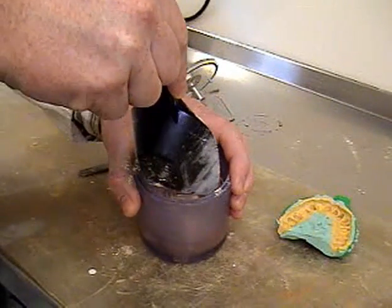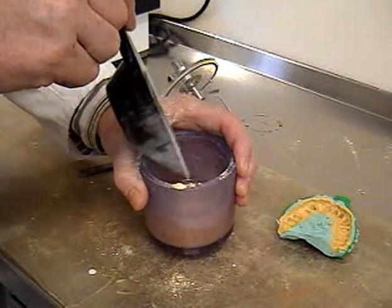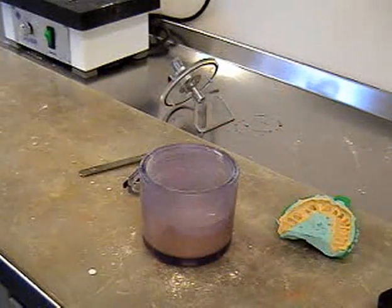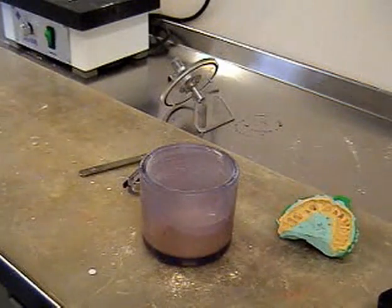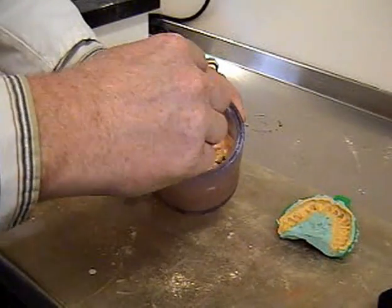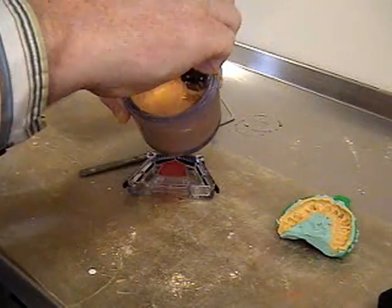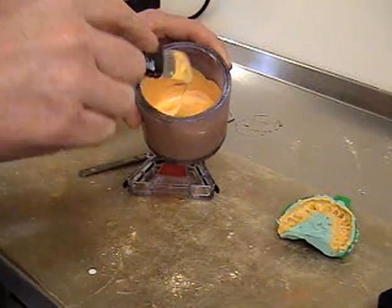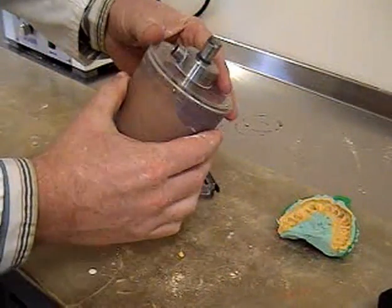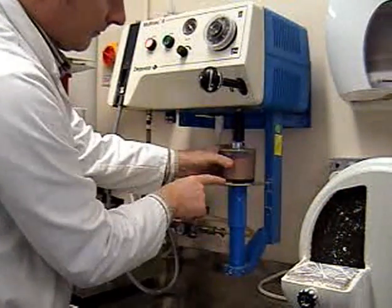So into the pot first with the water, and then we're going to take the 100 grams of die stone powder — that goes straight in. Once you've mixed the material, you're probably going to have about five minutes working time, so you don't want to stand around gossiping — there's no panic, but get on with it. Clean the top of the pot because this is vacuum mixing and we need to create a nice seal. I'm just hand mixing it to start with, just to incorporate all the powder into the liquid so the powder doesn't get sucked up into the vacuum mixing machine. On with the lid — we've got a good seal; there's a rubber seal on the bottom of the lid. It clips into the vacuum mixing machine.